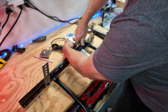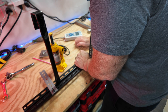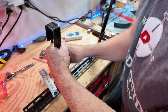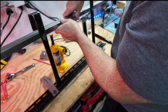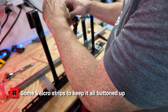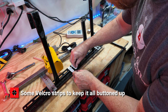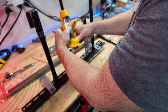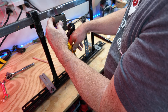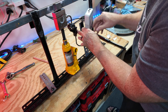I bolted everything to angle iron and created a nice little stand. I also bolted on a mount for the Nextech DFS XL3K, which is a push-pull tester. With the bottle jack, I simply put the sample in the rig and start applying pressure. I want to thank the folks from Nextech for providing the gauge, and they also provided the hardware for the pull test, which we might be incorporating in the future. I like it because it's easy to use and has a max setting.